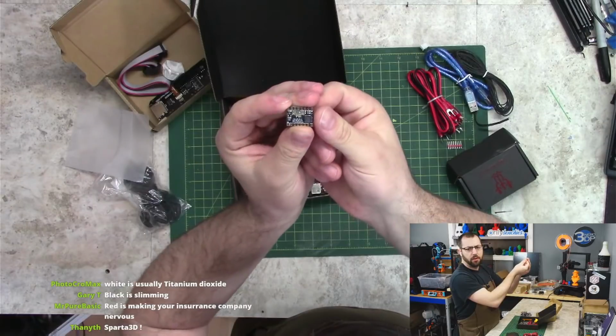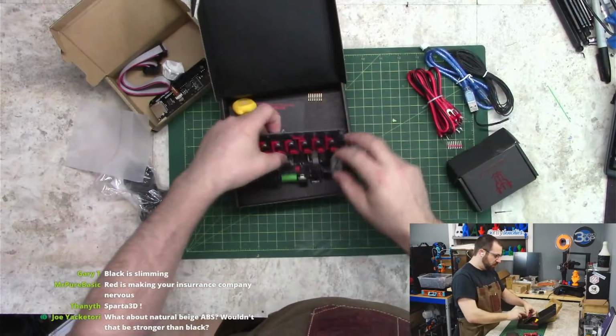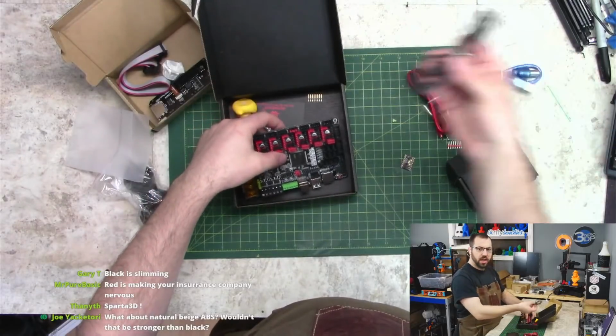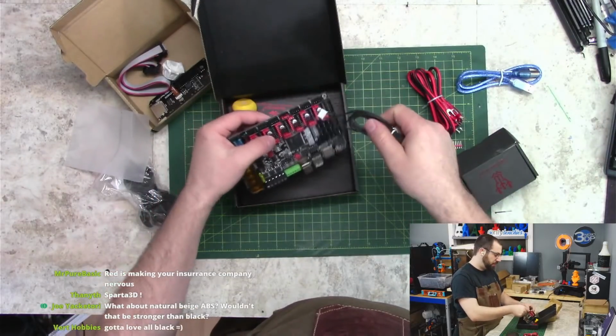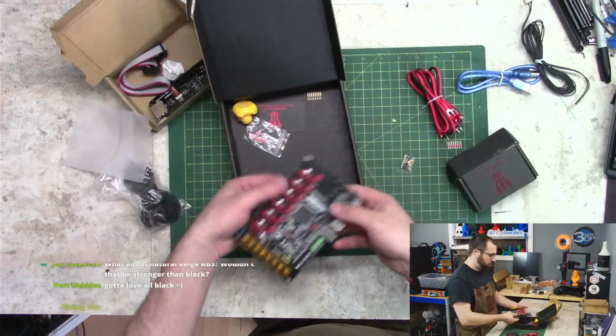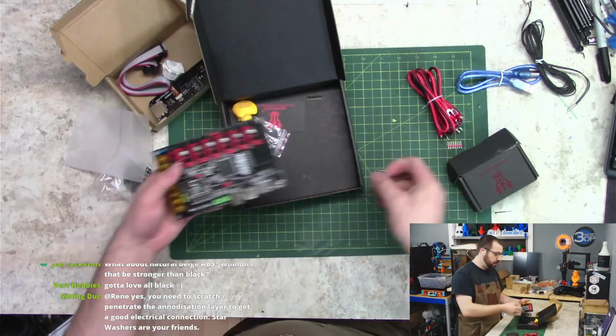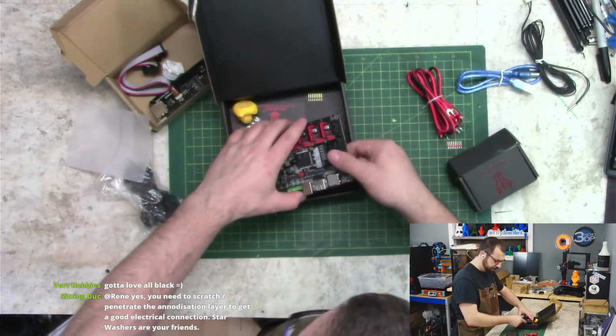step stick, essentially. So this plugs into an open driver slot so that you can take your PT100 sensor and plug it into the motor slot, and then you have PT100 support on most boards. Now, there are some boards coming out with built-in PT100, but this is not one of them. So that's what I'm going to be using there.